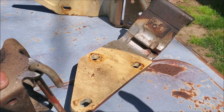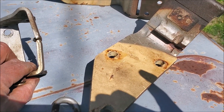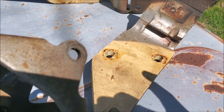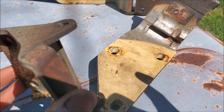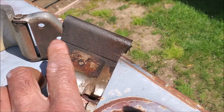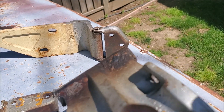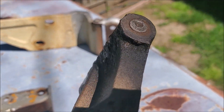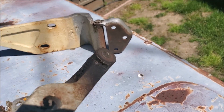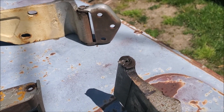This is a hinge I actually took apart. What had happened is that I wasn't able to get the pin out and had to grind it off. If you look carefully, there's a serrated edge where the pin actually sits, and it should sit solid in this bit and rotate on the long bit. But typically what happens is they seize up in the long bit, like in this case — the thing had snapped. I couldn't dismantle it; the pin is rusted in there and it's not going to come out. I may have to use a press or some heat to get it out, but this is a scrap one anyway.